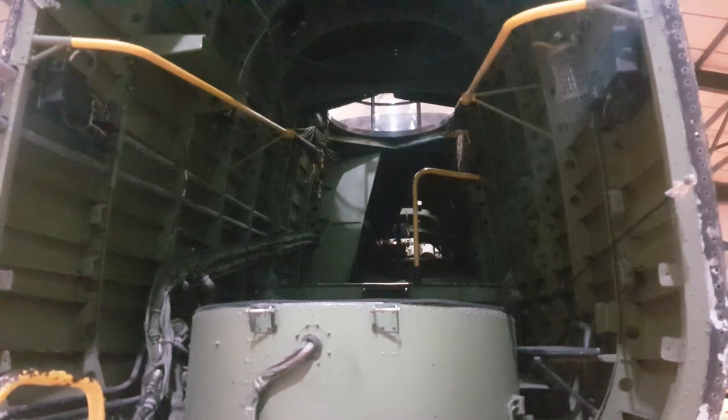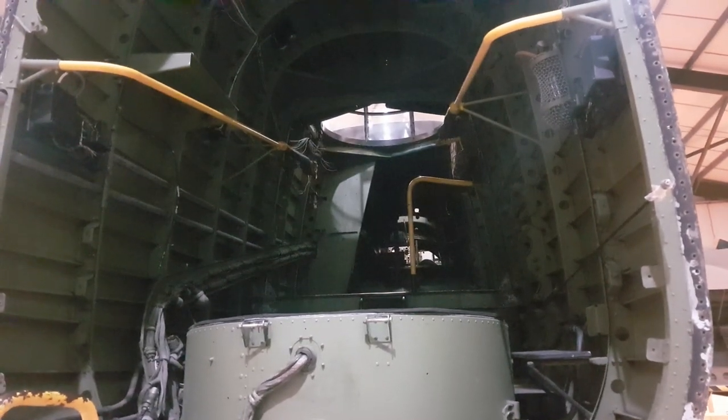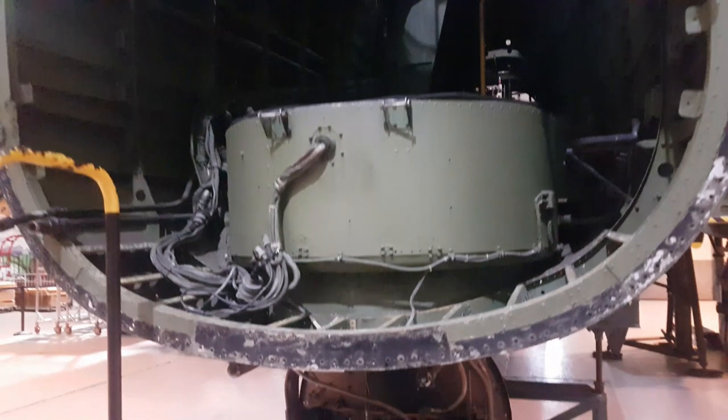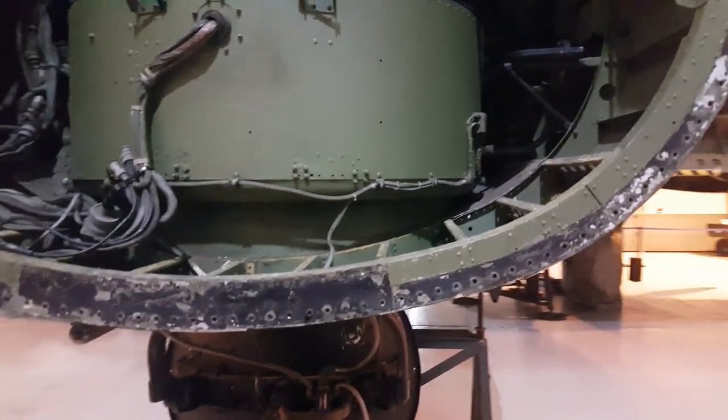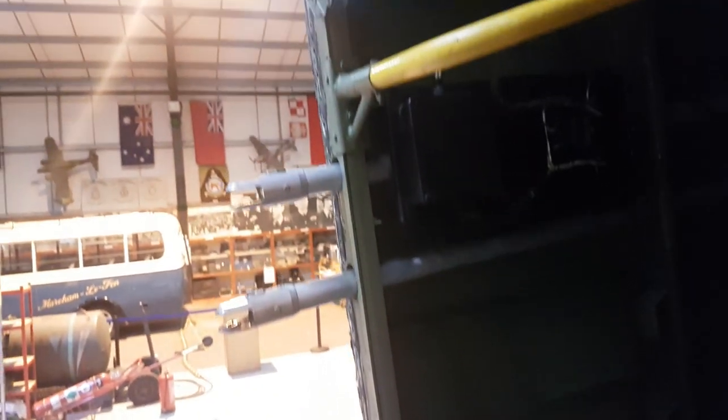On the forward face you can see it was painted as well at the same time, so hopefully that has done the same job and preserved that face. Looking forward towards the cockpit, straight in front is the H2S — the top of the scanner where it sits. In the floor you can see all the small intercostals which run forward to aft, the pitot-static tube hanging out, and the flying controls on the port side hanging out. The entire structure in the rear will have to be inspected and all the rivets replaced next year when we come to do the rear fuselage restoration work — you can see the sheer number of small parts and rivets, which shows how big a job it's going to be.